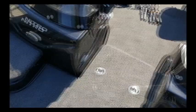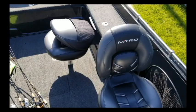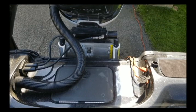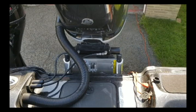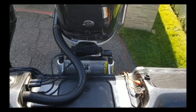And I guess if all else fails you can put fish in the cooler. As you can see it's a dual console — that's pretty much the boat. I should mention for serious fishermen who don't know about the Atlas jack right here — it moves the motor up and down six inches. It really comes in handy in shallow water. Instead of just tilting it up, you can move the motor up and still have more control over your boat in shallow water because that motor stays more vertical.